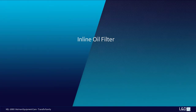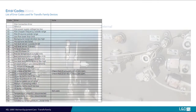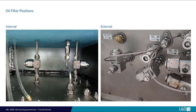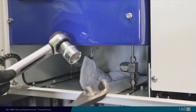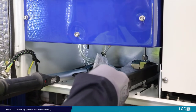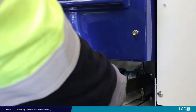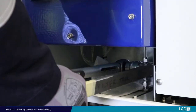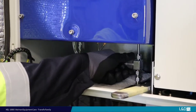The Transfix family inline oil filter. This may be completed as either an equipment care task or a resolution to an error code — see each equipment manual for error codes. The inline oil filters may be positioned inside the monitor at the bottom of zone 2, or externally mounted as with TapTrans. The procedure for all Transfix family devices is similar. Ensure the recommended preparation is carried out. Additionally, close the Kelman oil supply and return valves. If the filter is correctly aligned to the monitor body, proceed as shown using a one-inch right-angled crow's foot and a one-inch socket. Hold and remove the filter cap nut as shown — care must be taken, do not bend or fracture the oil lines. When the cap nut is removed, a small amount of oil may leak out. Clean and replace the filter housing as required.